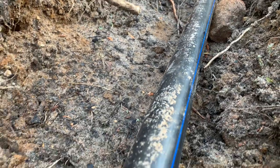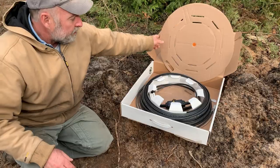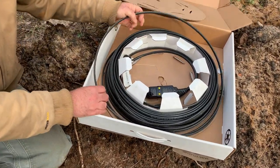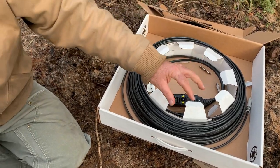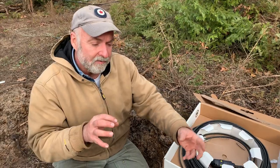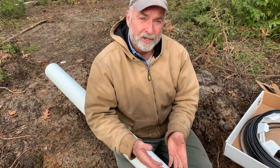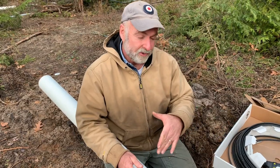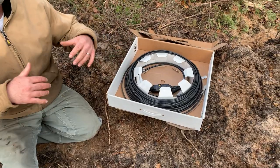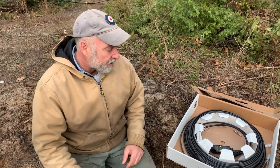We're going to be using a cable to heat that water line. We're going to be taping it to the outside of the water line, then encasing the whole thing in an insulating sleeve, and then putting this PVC pipe over everything to protect the insulation mechanically and to stop it from getting waterlogged. This cable is also going to be controlled by a thermostat, so it'll only come on when things get cold enough to get near freezing.